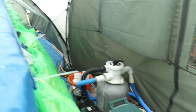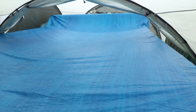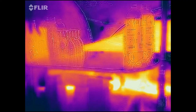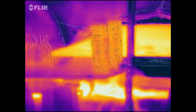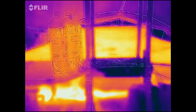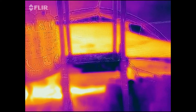What I want to do is have a look at this pool, so I'm going to switch on the heat camera. Here we can see the white layers underneath the pool — that's where the heat's escaping. You can see the ladder, which is relatively cold, but you can see this huge blanket of heat escaping at the top.